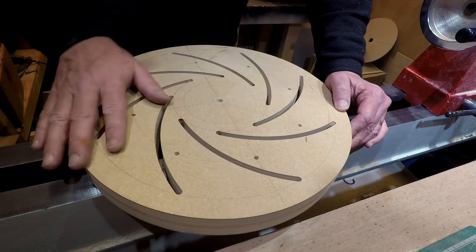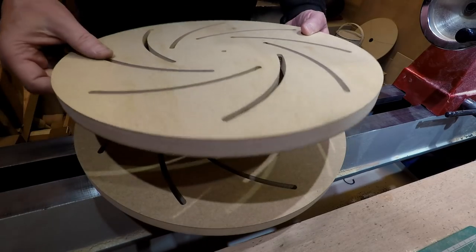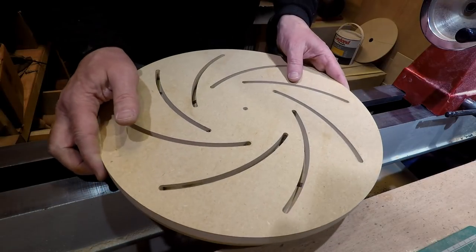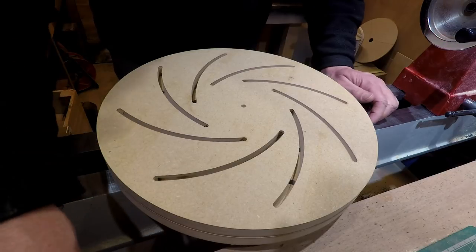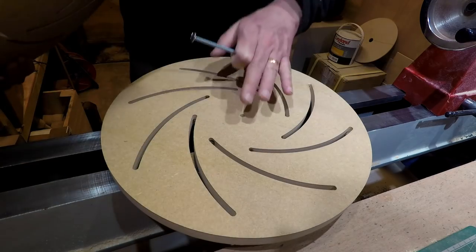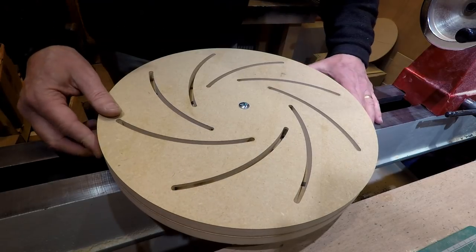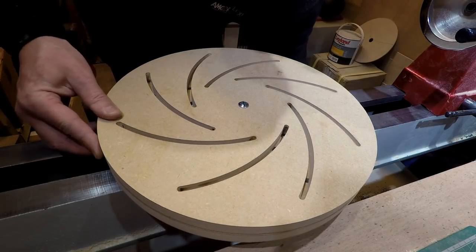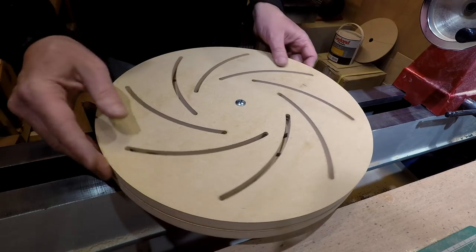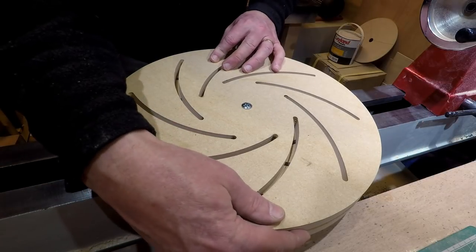The thing to watch when you cut these out is that if you go right back to where the circle joins properly, your cuts can get too close to each other and weaken the whole thing. What I did was put a mark halfway between each dividing line and started from there, which separates them nicely. Once cleaned up, all the tape marks are off the back — fairly clear, nothing sticky. The next step is placing the two discs in opposition and using a washer in there so it slips nicely. There's a small amount of play which may go once tightened up, and I can see the hole is fairly central as it rotates.